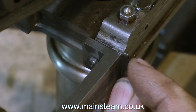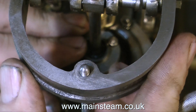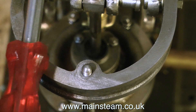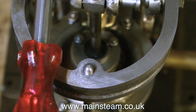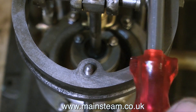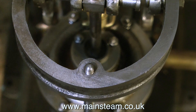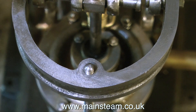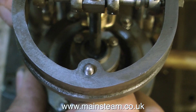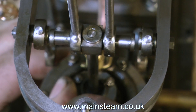The first thing I'm doing here is putting a shim in the end of the horseshoe-shaped piece to see how easy it is to move it across. This is not the fix, it's just a temporary measure — I could have used a screwdriver blade, but a piece of shim is more civilised. What would be really useful is if the support standard that goes from the cylinder to the horseshoe-shaped piece was actually in the centre. Look where the hole's been drilled — it's definitely to the left. If I was to make this hole bigger, or needle-file it out and make it oval, that would definitely allow some more movement to the left. When I put a little bit of pressure on it, as you can see, it moves quite easily.